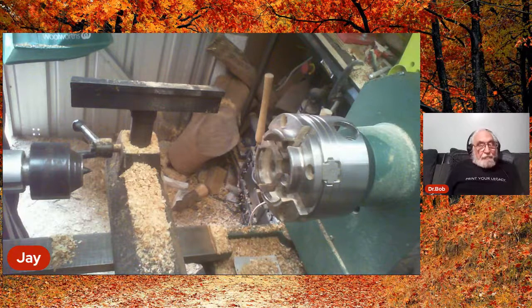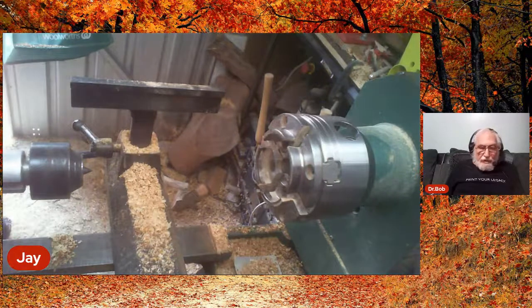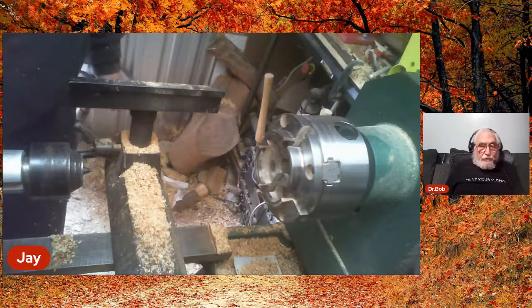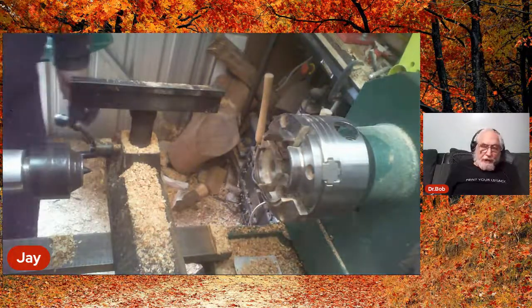Yep. You just have to remember, and it's a cheap thing to buy, a bandsaw tensioner. They usually give you a little knob that tightens at the top of the bandsaw, and it moves the wheels apart. So you apply more tension on the blade, because thinner blades don't need as much as thicker ones do, in theory. And that's debated to be just the opposite depending on the kind of work you're doing, because you can do almost like scroll saw, real fine work on a bandsaw with a 1/8 inch blade.